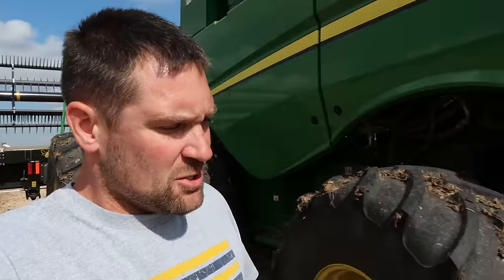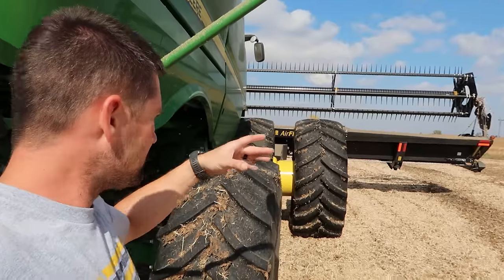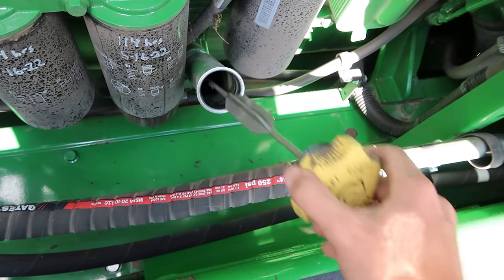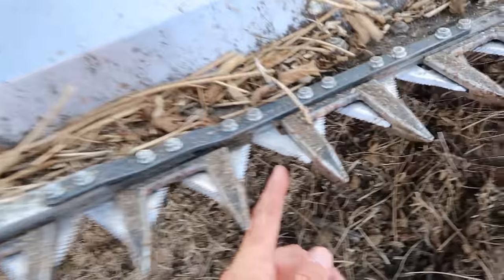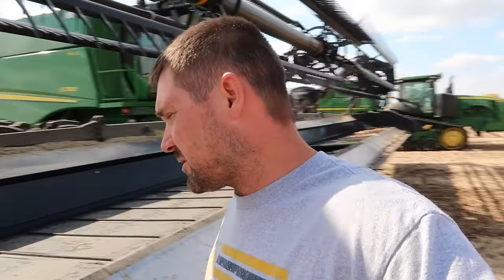We're going to look over our heads - there's always a few sections to replace and maybe fuel up. It might be 40 minutes before we're going anyway, and those will dry fast now. So maybe in 40 minutes everything will be ready. I know my head should be good because last night we actually had to fix a piece of the sickle section and replaced a couple sections. I've got a few sections that look kind of worn but they're not bad. This sun and wind has got to be drying stuff fast, so I don't really want to tear things apart - I just want to get going.